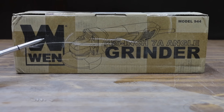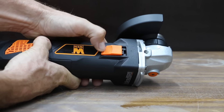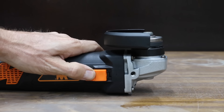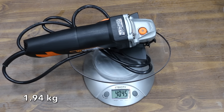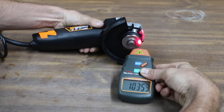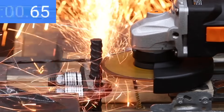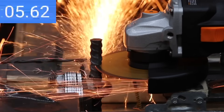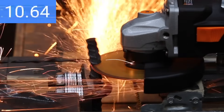At a price of $27 — almost twice as much as the Warrior — is the Wind brand. Just like the Warrior, the Wind also has a lock-on switch. An arbor adapter allows grinding wheels for both 5/8 and 7/8-inch arbors. It has a 7-amp motor generating up to 11,000 RPM, and the Wind weighs 4 pounds 4.5 ounces. At 90.4 decibels, it made it to 10,390 RPM — 610 less than advertised. The 7-amp motor gives the Wind a big advantage over the Warrior, though it still experienced a significant RPM drop under load. The Wind made the cut 3 seconds faster than the Warrior at 10.7 seconds.